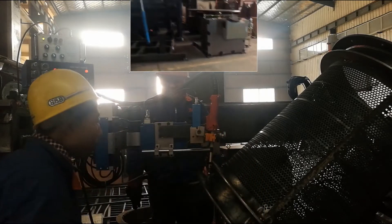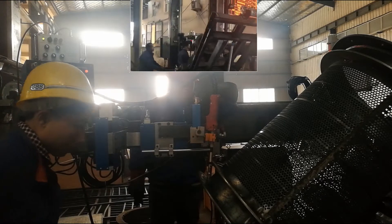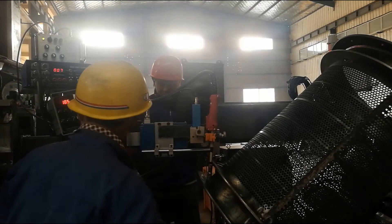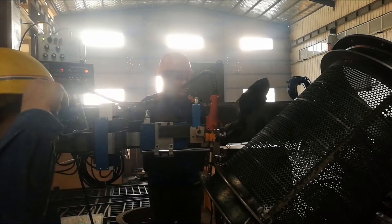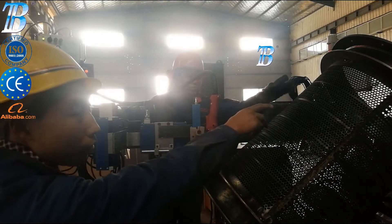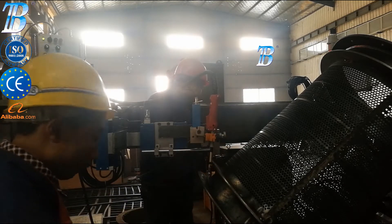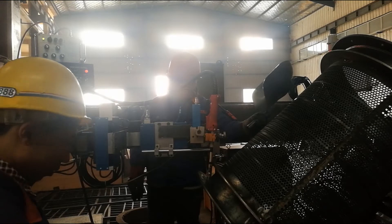Welding Seam Tracker. It is a unit for tracking down the welding seam line with the precise probe sensor KBTS-03. The deformation of workpiece is sensed and detected, and the deformed value is controlled in the controller KBSTCB. Therefore, it is possible to automatically correct the deformation on workpiece.